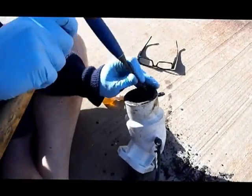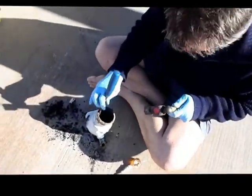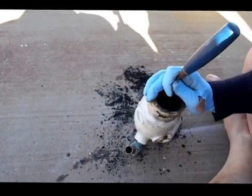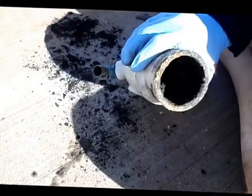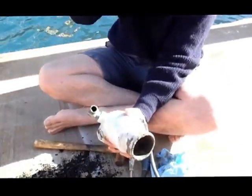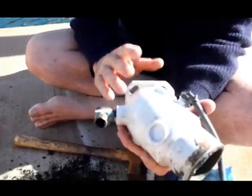So this is part two. After sitting around and looking at that exhaust for the next day, I came to the conclusion that we had made progress but hadn't made that much progress. We still had steam in the exhaust and we shouldn't have steam in the exhaust, so something is still wrong. So we took off the exhaust elbow — the exhaust elbow was almost completely clogged, and this is us trying to beat the clog out. We're going to explain what an exhaust elbow does. Where we are now: we fixed the sea water cooling pump, and we still had steam. The pump impeller blades had been changed, the heat exchanger cleaned, and yet we still had steam coming out of the back of the engine. So the next thing we did was take off the exhaust elbow.